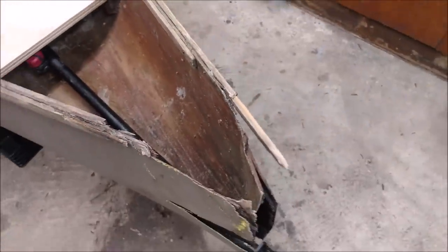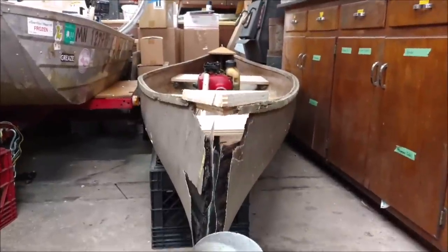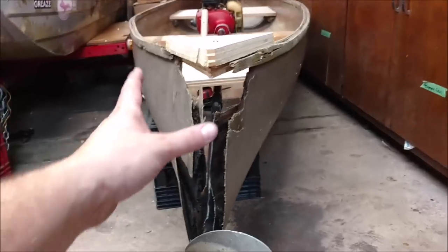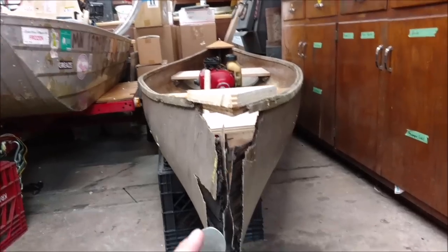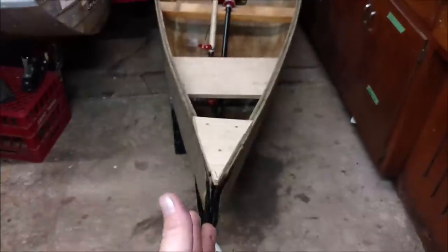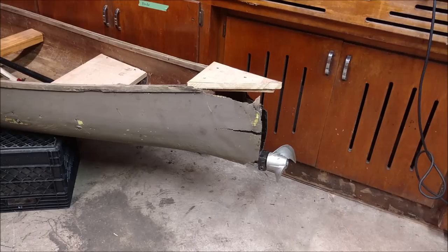Now that we've fixed up the bow, we've got to probably put some wood reinforcement in this stern as well. It might be hard to make out, but it's not quite straight. And I'm not worrying too much about it because I'm going to cover this entire area in fiberglass to hold it all together. As long as this stays waterproof and structurally sound, I'm fine with that because I think this is going to float. All that these wood pieces are doing at this point is reinforcing the stern to keep it structurally sound so the fiberglass can hold it all together. So I'm going to flip the canoe over and rough up that damaged area, take some of the paint off, and just kind of prep the existing fiberglass — whatever there is remaining of it — so that we can layer on the new fiberglass.